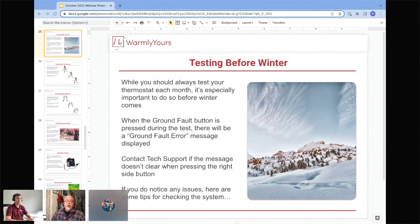We have a question from Brenda: 'If my control says ground fault error, should I be turning it off and getting an electrician?' The simple answer is just try resetting the thermostat — you may have a nuisance trip. Press the side button briefly to see if it clears. If not, press and hold for five seconds to turn the unit off, go to the panel, turn the circuit breaker off for about 30 seconds — just like resetting a router — turn it back on, then press and hold the side button for five seconds. That should fix it nine times out of ten. If it doesn't clear, you may have trouble with the system in the floor.